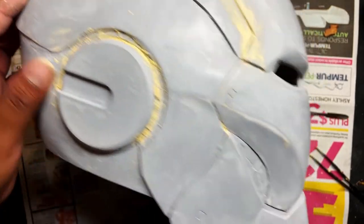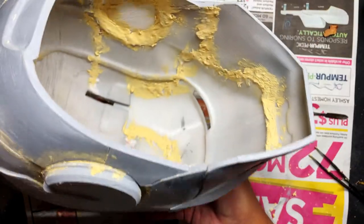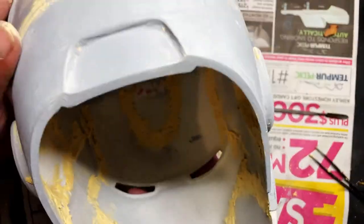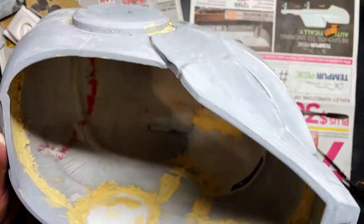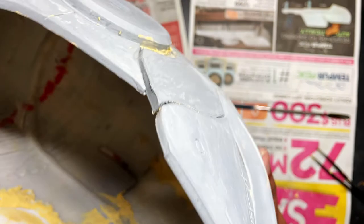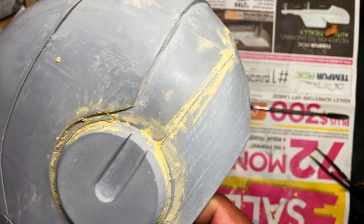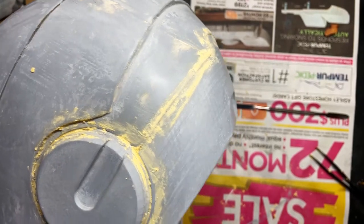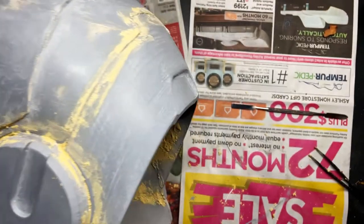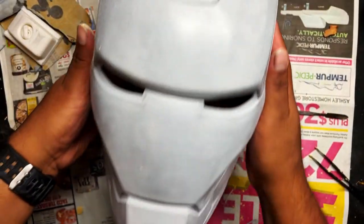All right guys, this is it — I'm going to let this dry. It's all plastic welded together, there's wood filler, and it's all staying in one spot. It looks ready to go. Basically the next step is one last pass with the sandable primer, and then we're going to sand it back down. Then we're going to do the painting and LED lights next time. Next episode we're going to do some sanding, painting, and LED lights, and it's going to look awesome. We're pretty much there — just trying to get this as smooth as possible, and we are going to be done in part four.